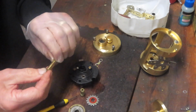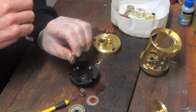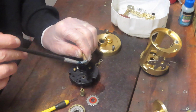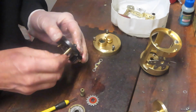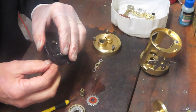Take a look at the shaft. Make sure that it's clear. Doesn't have any debris. Kind of roll it around. Make it feel smooth. Put a little bit of grease back in there because that is a friction point inside your bearing. Then we'll just turn right around on this. Put that back in before we get too lost. Reseat that bearing.